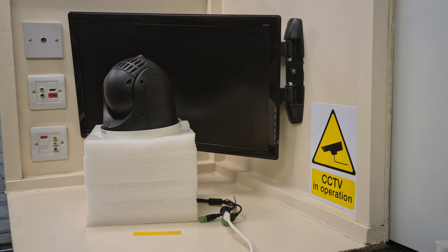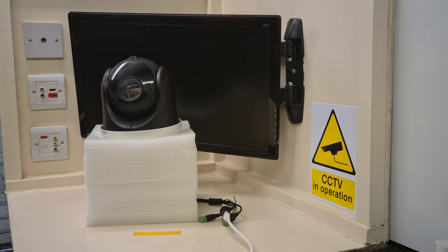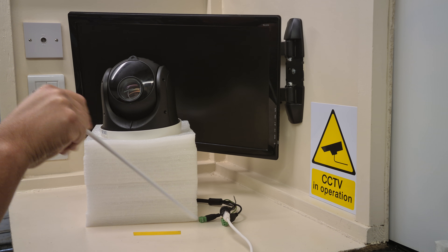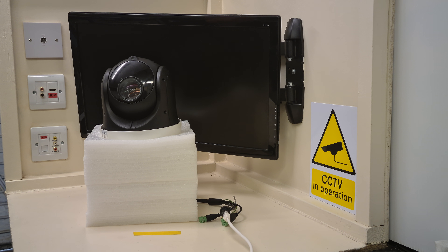No reason to believe it didn't work — of course it worked when we took it down after its three-month test. The camera is upside down at the moment just so you can see it booting up. What's excellent about this camera is that while a standard camera looks straight out at zero degrees and tilts downwards, this one has negative 15 degrees so it can actually look slightly upwards. The 225i with the auto-tracking facility would only go up to minus five degrees, so if your building is quite low and you need to look up a yard, this is the one for you.